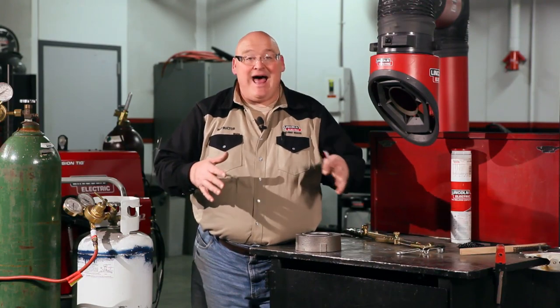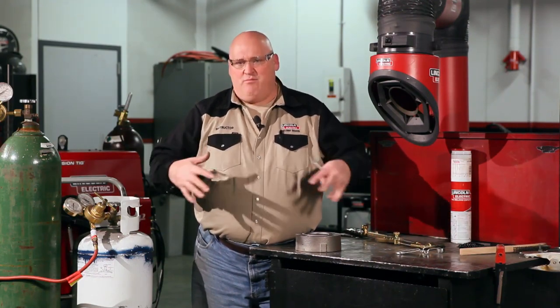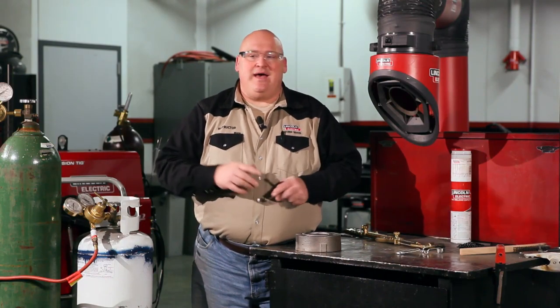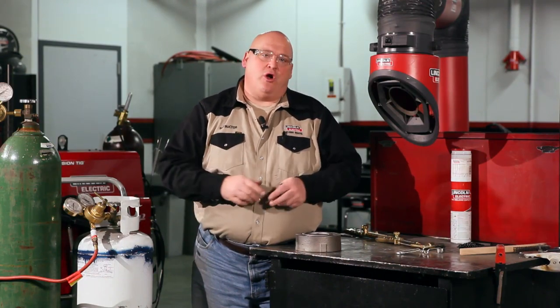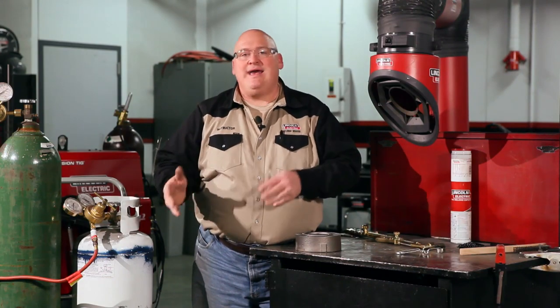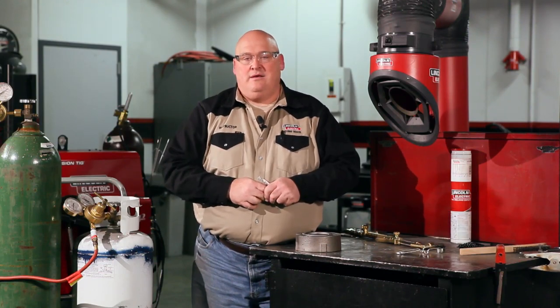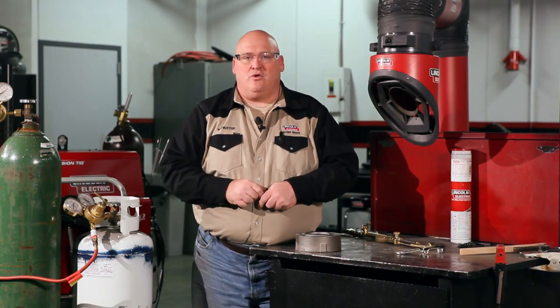So one of the things that I do is I put charcoal in a grill and let it burn out. When I'm working on the casting, after the charcoal is burned out, I'll throw more charcoal in it. I'm done with the casting, welding on it for 2 hours. I throw the casting in a charcoal grill and let it come down for 2 days, and it's still warm when I get done. That's more or less something that we can do to control thermal care when we're trying to repair things at home.